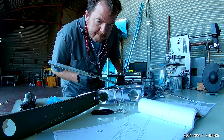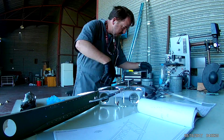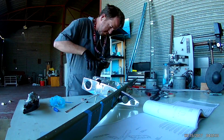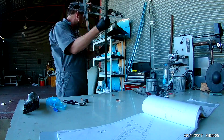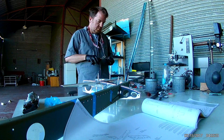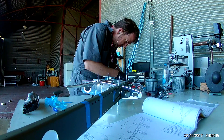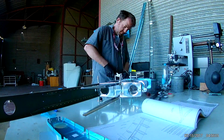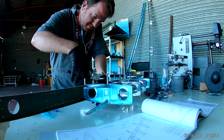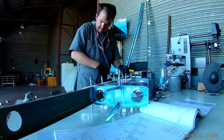So here I am mocking up what that looks like. You put the two modified ribs in the center along with two modified nose ribs — so you modify two nose ribs and two center ribs. This is so that it can create an angle in between the front and the rear spar, and this is where the horizontal stabilizer attaches to the fuselage itself.